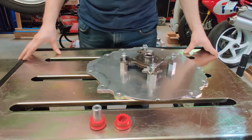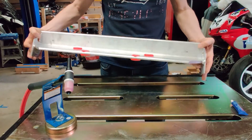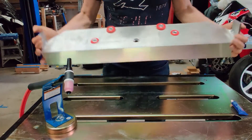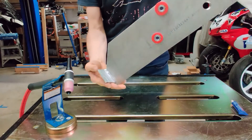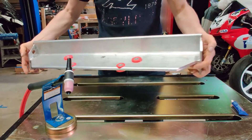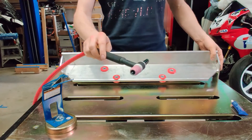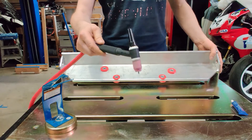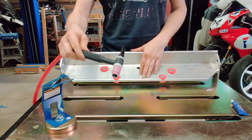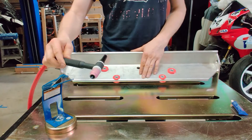I'm done welding — the side brackets are welded, as you can see. These might not be the most beautiful welds in the world, but they will hold up. This piece is a little challenging for my TIG setup. I only have a compact size 17 torch, which is a medium-sized air-cooled torch, so with this gauge of aluminum it gets pretty warm quickly. I have to take breaks to accommodate for that — maybe at some point I'll upgrade to a water-cooled torch.